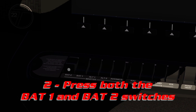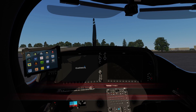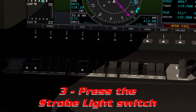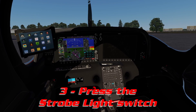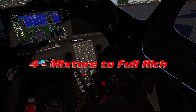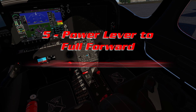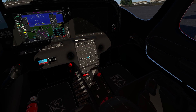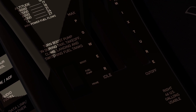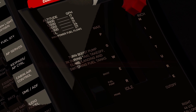Battery two. Battery one. Strobe light — let everybody know that you're about to prop the engine. I'm moving the power lever to full forward, only so I can fully enrich the mixture. The fuel pump switch is right here, to the left of these labels, and I'm just going to push down on boost and leave it there.